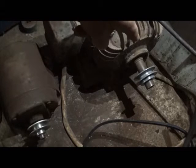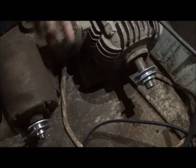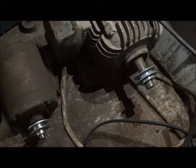All you've got to do is get your idler motor spinning, turn it on. You really don't have anything extra to make a phase converter. You've got to have your 220 single phase and an idler motor, and then of course the way to start it. Like I said, I was using a static box before, and this is just a pony motor start. But it'll work for now, and that'll get me to machining anyway.